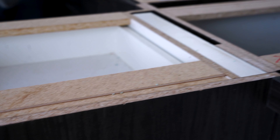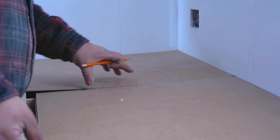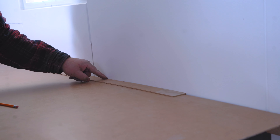Here are the steps. Simon's giving me a sneak peek at what I'm in store for — I'm going to grab my camera and follow him around so you get to see all the steps as he does them. Basically, we want to make sure our template fits all the way across the entire space, taking into account how the walls are bowed. When I take this into the shop and set it back on the table, it gives me my point of reference so the pieces go back together the same way they came apart. There's a very small gap in the wall, so we're going to hot glue some pieces in along it to close that gap and keep everything as form-fitting as we can.